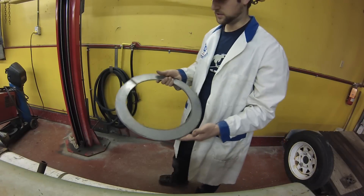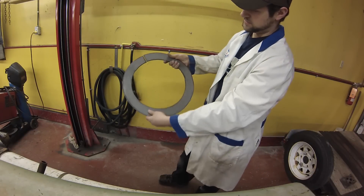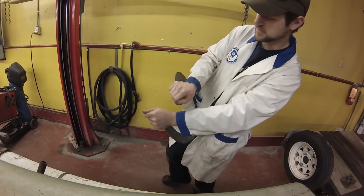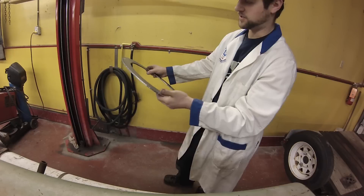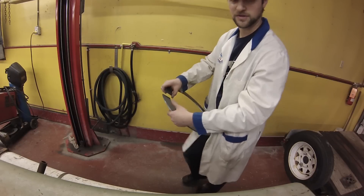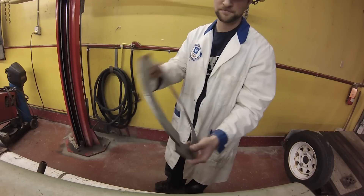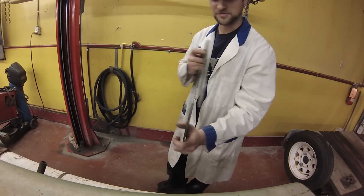I do have one ring cut out here, so I can put that slice in there — that's going to be one of my flights. What I'm going to do is bend this ring open, as you can see. Obviously I'm going to bend a lot more than that; I don't want to do it until it's on the pod, but that's what's going to give me my screws. I'm just going to keep opening them like that and attaching the next one and keep going with it. This is three-sixteenths plate steel I'm using — I think that's about the thickest I'm going to be able to bend with the tools I have.